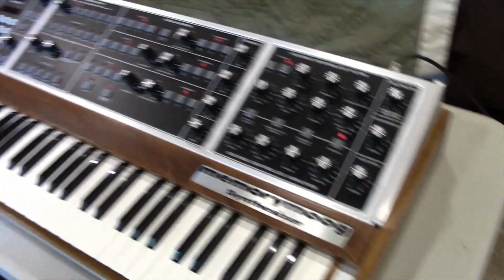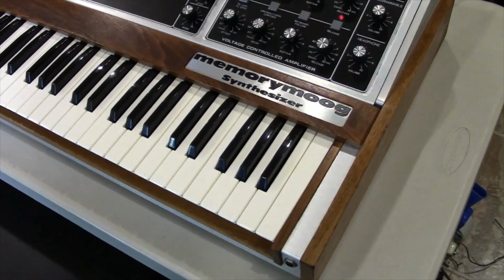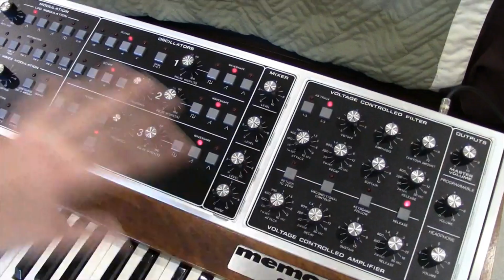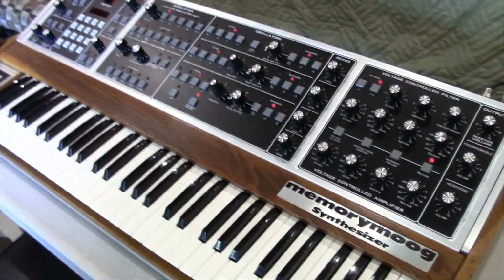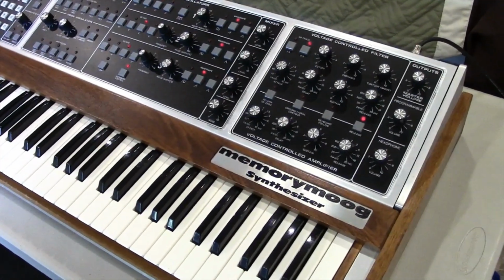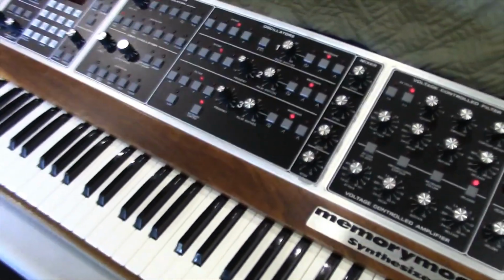And like I said, I think you're going to be really happy with this thing, Eric. It's a lot different instrument than it was when I got it in here. This thing didn't work too well. It would power up, but it would just glitch, and it was noisy, and had several problems. A lot of it was in the demux. It had some voice issues. It had a bad 3340 on the oscillator on voice 2 or voice B, depending on what you want to go by.